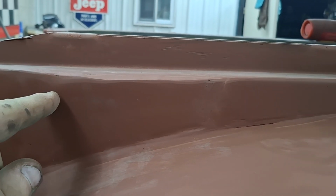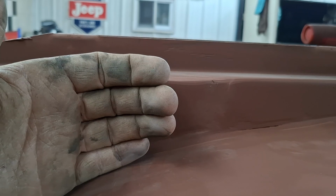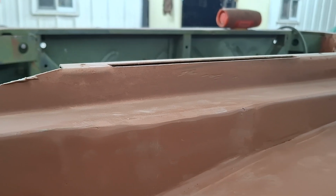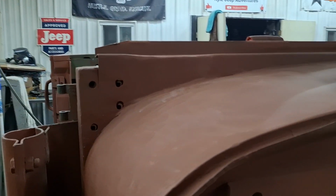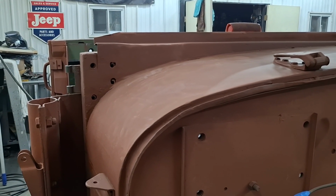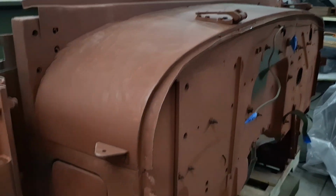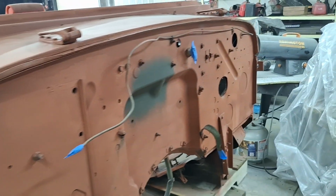I'm almost done, and then I put a piece of steel behind it so it doesn't deform, and then hammered it over, and then welded across it. Done. So fixed. That's the last section of rust on this truck to fix. So we're done. And then, yeah, filled the holes in and bondoed, and it's done. So I'm ready for paint at this point now.